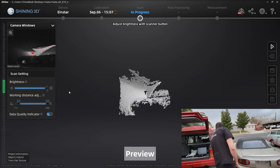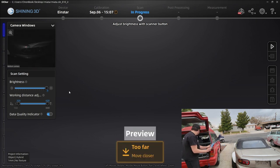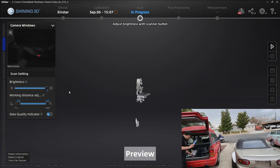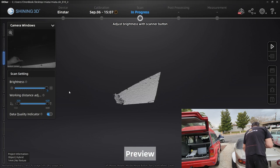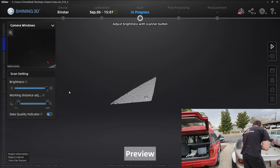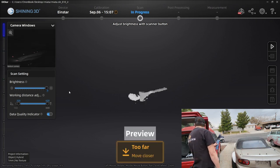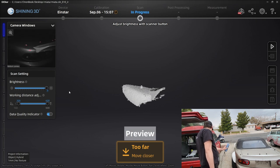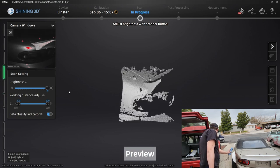Here we have the back of the Miata. Let's scan this trunk. Let's throw some of these little marker pyramids on — I'll throw the link for the marker pyramids in the description. These are super great for saving your markers and not wasting them; you can throw them on and then cut them out in the mesh later. We toss some markers on, just in case, since we're using hybrid alignment. Now let's get some features showing and then we'll start our scan.